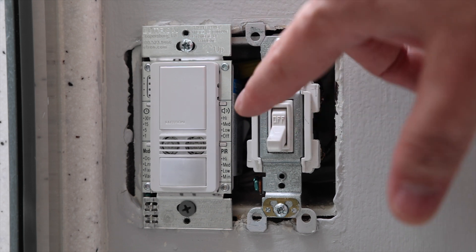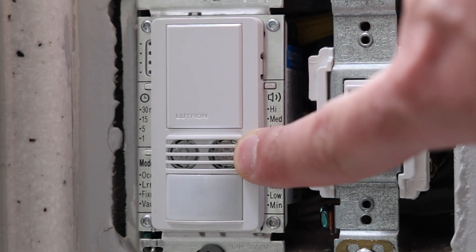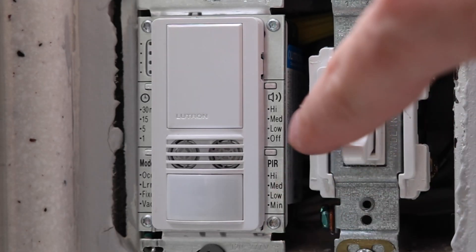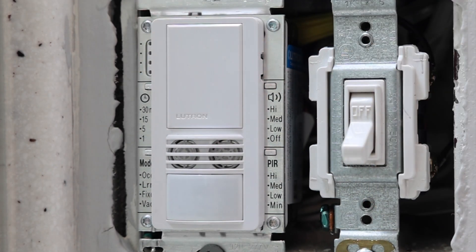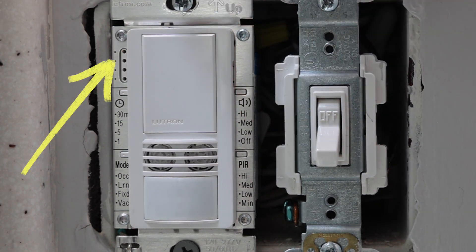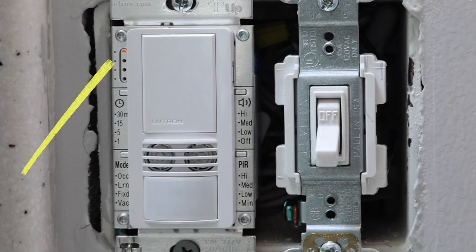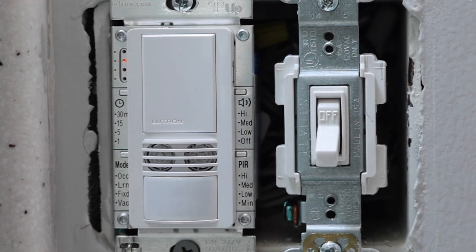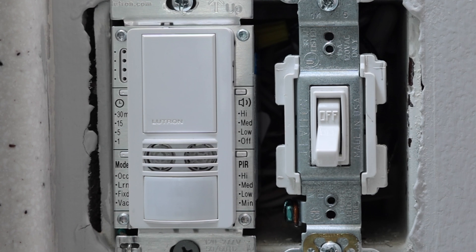So once you get this thing off, we'll start right up here in the upper right corner. This is the ultrasonic sensitivity button, which determines how sensitive it's going to be — whether it takes a lot of noise or just a tiny bit to turn the lights on. If you want low sensitivity, you set it there; then medium, high, or off altogether. You can tell what it's set on by looking at the LED lights on the left side. If we push this button once, we can see it's currently set to high sensitivity. To change it, push and hold it down until the LED light starts to blink, then push again to cycle: off, low, medium, high. Once you're on the setting you want, push and hold again until it turns solid.